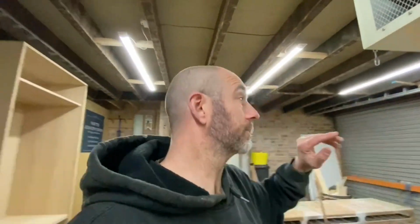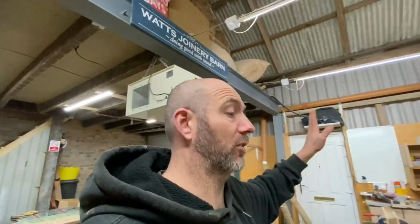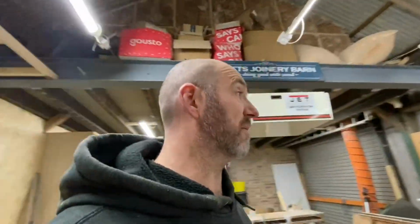Right, it's the end of the day. Everything that I've been doing today is up in the paint room now. That's not up there drying, it's just up there keeping warm, because I can control the temperature in the paint room. So that's the 6 drawers, the 2 doors. I've also cut all the end panels, sanded them and put the edges on. These 2 units, I've sanded those. Not those 2, obviously, they're there, but the bedside table and the other unit that was there this morning, I've taken the edges off of those, sanded those, got them ready, and all the end frames have been cut.